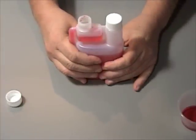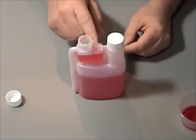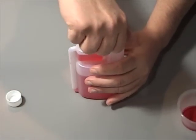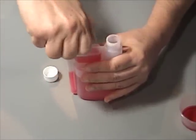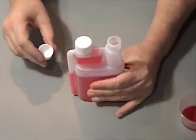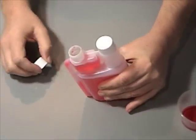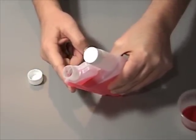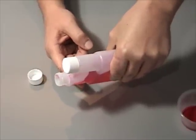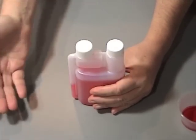A couple of little tricks: let's say you get too much in the cavity or you decide you don't want to use it right now — how would you get it back in? Here's the trick: open this side, squeeze the bottle quite a bit, then close it. Now open the other side and tilt it over to where the hose comes in, and slowly release — it'll actually suck the epoxy right back in. There's a tiny amount still left, but it takes almost all of it out.